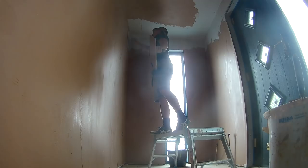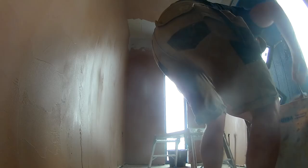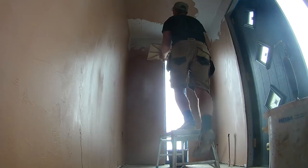So that's what the score is. As you can see I'm still applying the plaster and my main aim is to get this room done. Obviously we're dealing with a lot of wet angles here, so on a side note, outside of the Extra Time product — when you are applying plaster, try not to be too heavy handed on the corners, and try not to get too much excess plaster there.